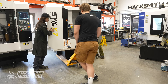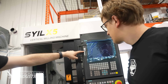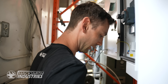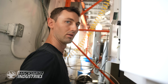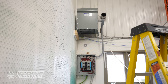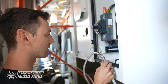We have the machines moved into place where they're going to live. We have to get them wired, plumbed, set up, trained, then we've got to make fixtures, load tooling, and we can start making knives. Look at what ports I got — Ethernet, USB 3, compact flash. These machines run on 380 volts three-phase, which is more of a European standard. At Hacksmith it comes in from the street at 208 or 120 three-phase, and then we bump that up to 600, which is what most of our other machines run at. Then it comes over to that big transformer we just installed, which buffs it down to 380 three-phase. Here are our three phases and ground wire, so really I'm just plugging that in.